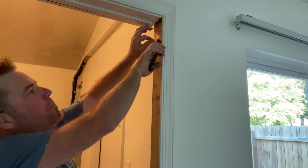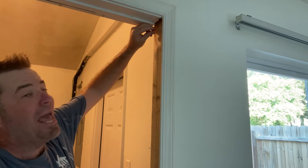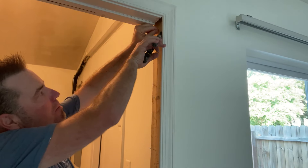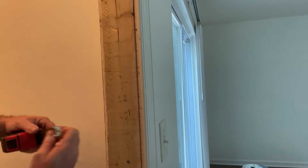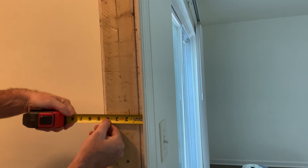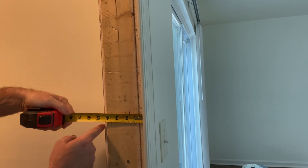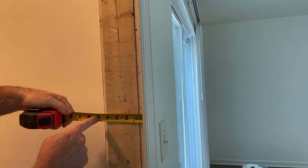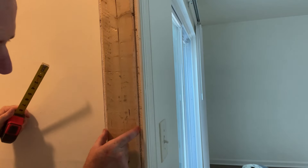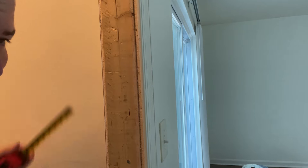Let's go ahead and clip the nail. I've got my trusty side cutters here and I like to hang on to the end of the nail. Now that we've got the nails cleaned up, we can measure what size board we need. From the casing to the front of the casing is about four and five-eighths. With three and a half and then half and half, you should be able to get away with a four and a half inch board.